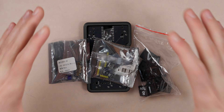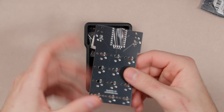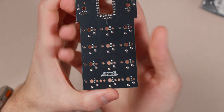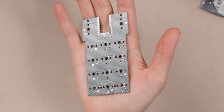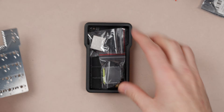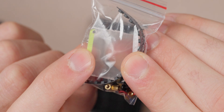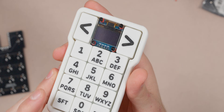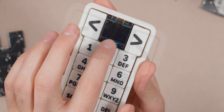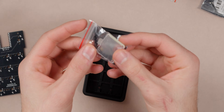On my desk right here is everything you will need to build the T9. We have keycaps, we'll talk about those later, we have an OLED, we have the controller. But the big thing here is, of course, the PCB. If I just hold that in my hand, look how small that is — it's really, really tiny. We are doing castellated pads for the controller, which are really nice because it allows us to keep it really low profile. We also have all the different components, including a little CNC-cut plexiglass cover for the OLED display. Here's a fully assembled one in white — you can see just how nice and low-profile it looks.